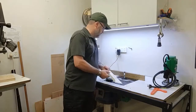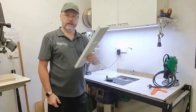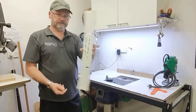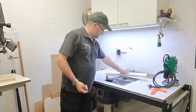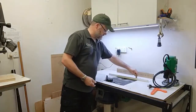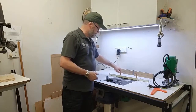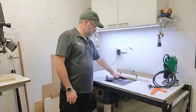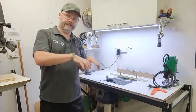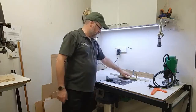When we cut fret boards we really want to have a very simple low fence. So we have this fence which we use in pretty much the same way. It gets attached to the table with a couple of hold-down bolts, and we can line it up, move it in and out, and use that to line up our necks and cut truss rod slots. That's the main job of that fence.